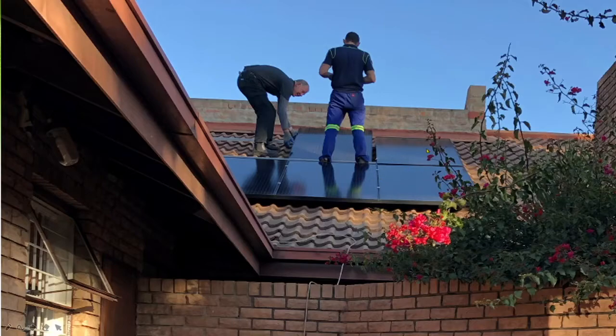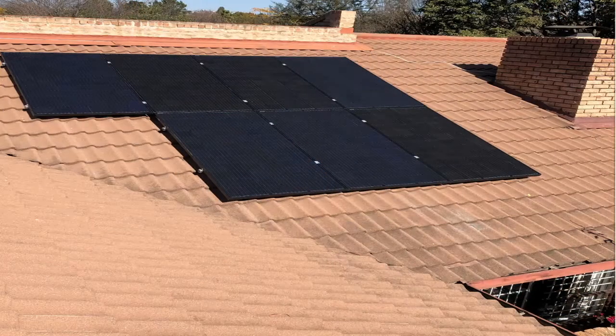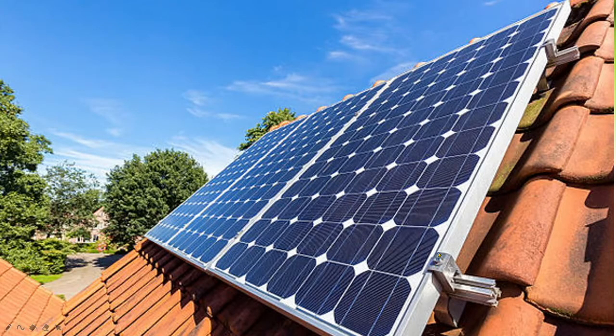If you have a flat roof, you'll probably have to mount your panels on a separate stand. This is how the installation looks once everything is installed — as you can see, the aluminium tracks are neatly fixed to your roof with no risk of the panels being uplifted in gale-force winds. You can see it's quite neatly fixed onto the roof tile, just under the roof tile, and fixed with a bolt.